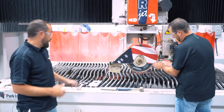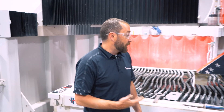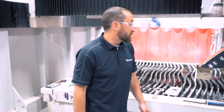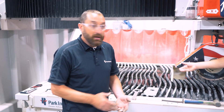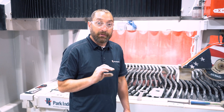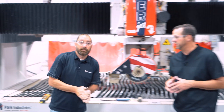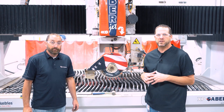After we did the advanced touch off for our Z-offset, it is a good idea to do a blade touch off to make sure that blade is completely accurate. A couple of other things that can affect miters is table level — anything that affects levelness — and making sure you have your height sensor calibrated, because if it thinks your material is a little thicker than what it is, that will cause your miters to be off. Thanks for sharing your expert knowledge with us, Josh. Hopefully that will help you in your shop and with your miters. Thank you again for joining us.